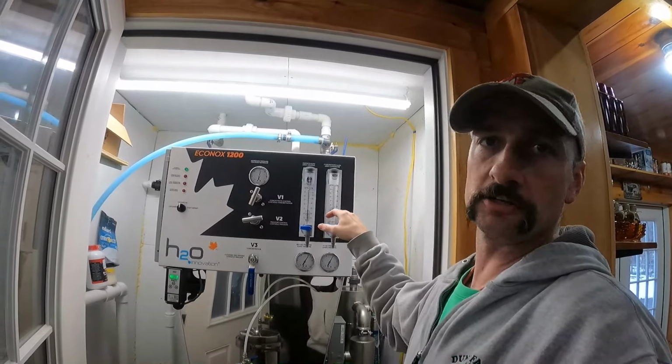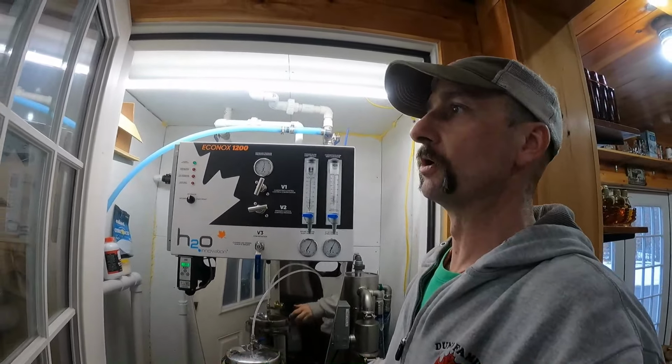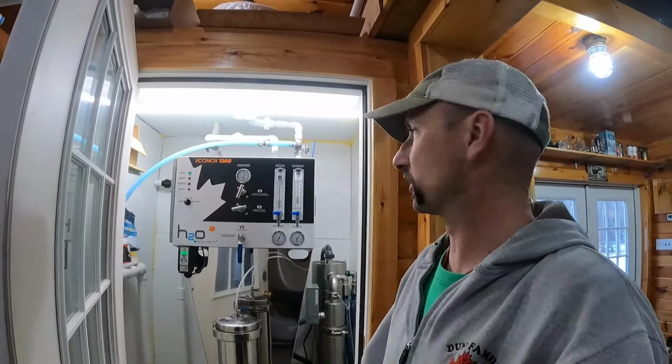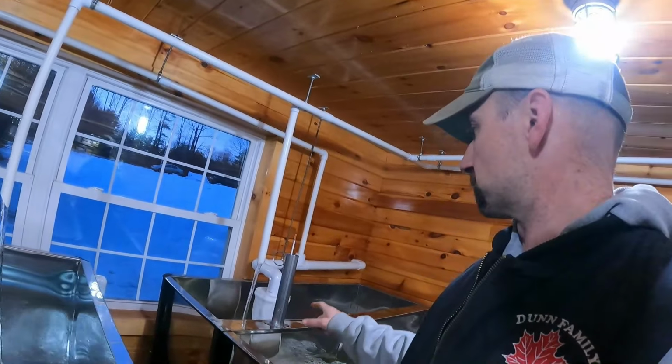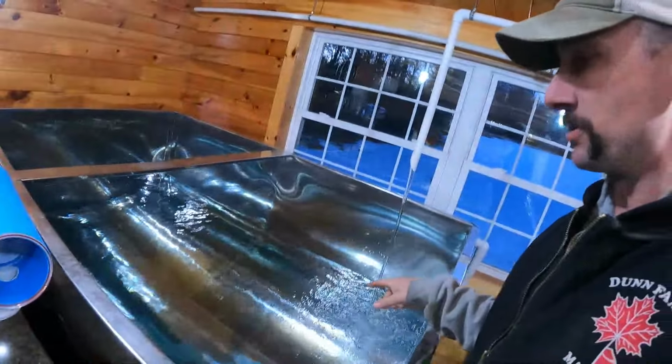I'm making 5 gallons of concentrate a minute and 14 gallons of permeate. So we'll plow through this pretty quick. But like I said, I don't really pound on this thing. I could turn the pressure up and really clean it out, but it's not worth it. The RO is chewing through the sap right now, making about 5.5% from like 1.3. Permeate looks crystal blue like it should. I'm getting ready to flip the valve here in a minute and throw it up to the head tank.